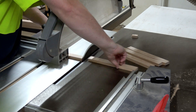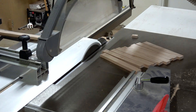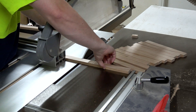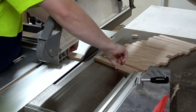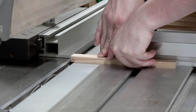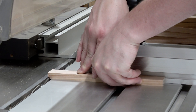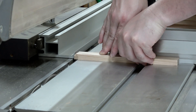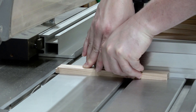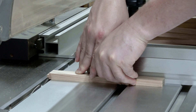Using the material prepared earlier for the slats, I'm just going to cut these at a rough length — approximately 40 millimeters too long — because I don't know the exact length at this point, as all of these slats need to be cut to match the curve later on. To position these into the bottom rail I'm just going to put a short little stub tenon on the end, and in just a moment I'll cut a groove along the bottom rails to accept these tenons.